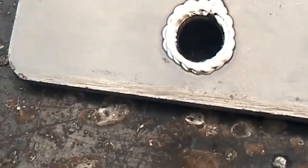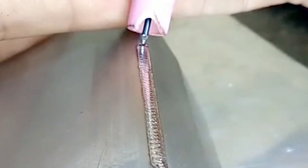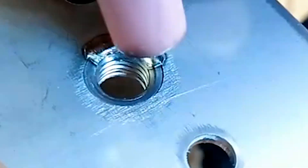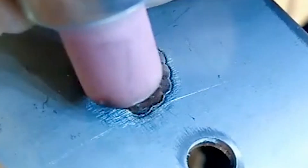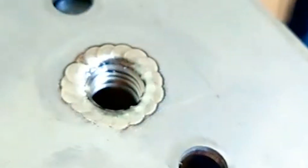When repairing bumps, it is also possible without argon gas, but the appearance color will be worse without argon gas shielded welding — it does not affect the quality of the welding repair though. Users can choose whether to use argon based on their own site conditions. There is also no need for argon when the covering function is used for electric spark surfacing repair. For all other welding repairs beyond these cases, argon gas protection must be used.